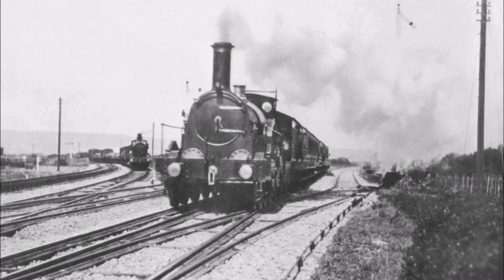He made a number of arguments about the benefits of the broad gauge. First, it would reduce frictional resistance of the wheels on the rails, because you would use larger diameter wheels, therefore they'd make fewer turns. This might seem a specious argument today given the high quality of modern steels, but back then with cast iron wheels and wrought iron rails, which were quite brittle, this had a major influence.